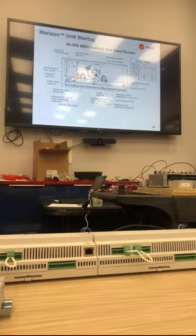It's because of that. We have found out that the burner is only rated for 31 mile per hour winds or less. Anything above that can cause you to lose flame. So are you seeing overheating issues at low fire now? No, it's minimal. From 0.2 to 0.4, we're not seeing overheating issues. Tech support told me to take them up to 0.5. I could go to 0.5. You could, but 0.4 is where we're comfortable right now.